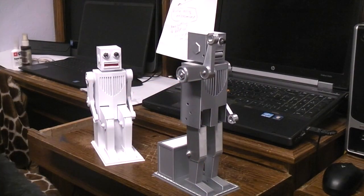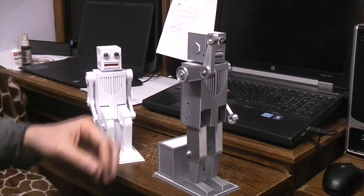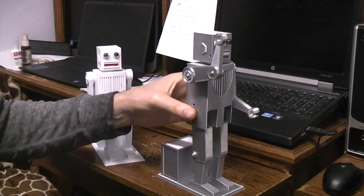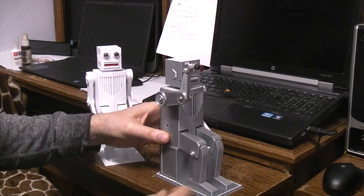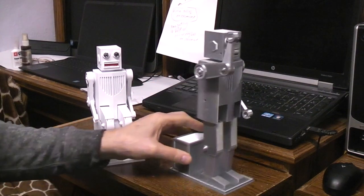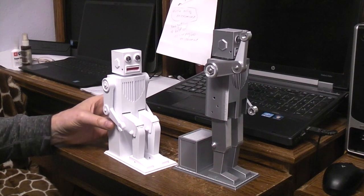The stand-up part is actually accomplished by springs and a pull cable, so you can actually, when it's standing, pull it down and let it come up. Every now and then it can hang up on the stand. If there's any sort of binding left in the plastic or anything else, it's not 100% happy. When it's in the sit position, though, you can't move it — it's being held down by the motor.